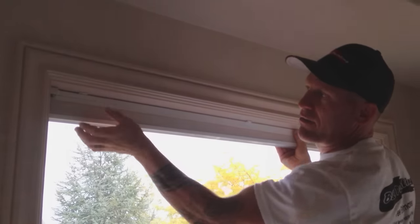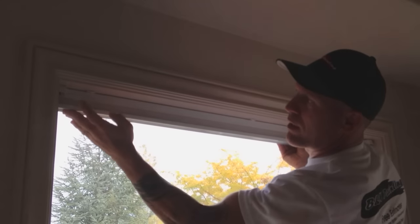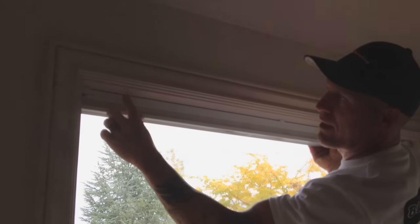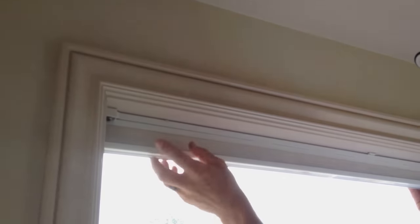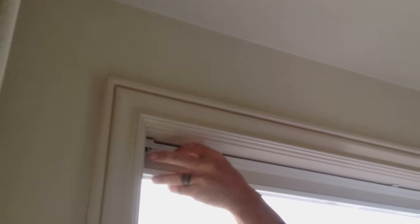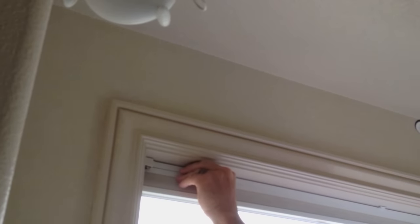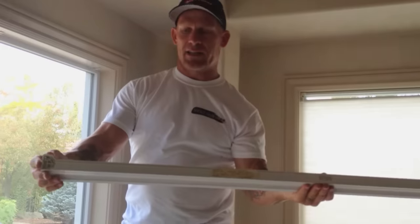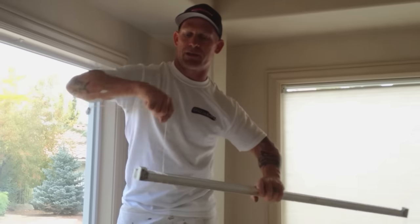When you reinstall it, set it right back in that same position and rotate it clockwise to lock it back in place. Push it up against the ceiling or up against the window trim so it catches and locks in place. If you don't push it up and it's hanging down a little bit, it's not going to actually catch the blind. So just take your blind, stick it up, push it up tight, rotate it, and it'll lock. The blind comes out simply with no tools — just take and line your cords out so they don't get tangled.